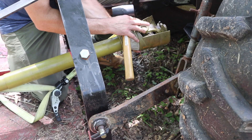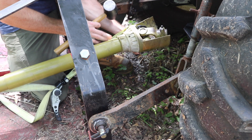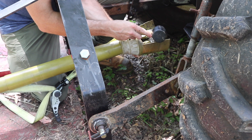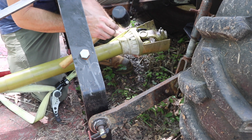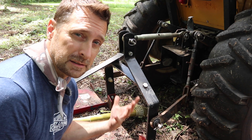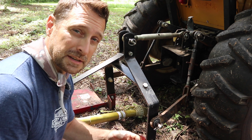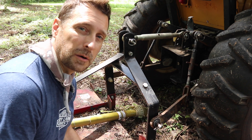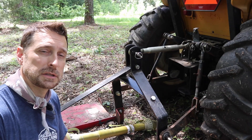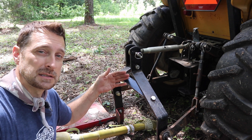If you're finding this isn't coming off as easily as you thought it would even with tension on the ratchet strap, what you're going to do is try to get in there as much as you can. Put as much tension on the strap as you can and just start hitting it around where this collar goes onto the spindle — that way it's going to start to break free a little bit. I didn't have to do that in this case, but that's an extra thing you can do if it's really stuck. Remember, you need tension on that strap first. It did take a decent amount of force to get that thing off. Your ratchet strap might have a different type of hook on the end — you need one with a thinner hook so you can wrap it through there. But this should work nine and a half times out of ten on a stuck PTO drive shaft, and pulling it straight back is the best angle.